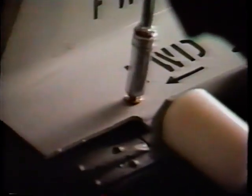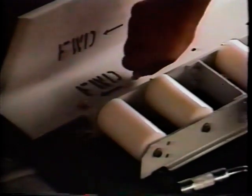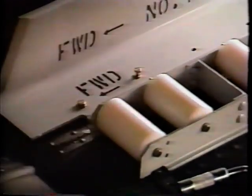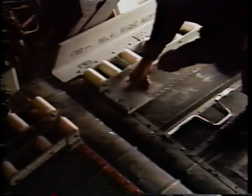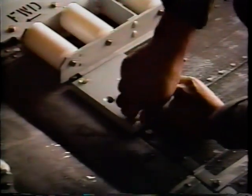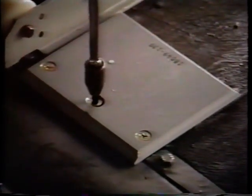To begin the actual installation of the ramp section, position the left and right hand outboard guide rails on butt line 41.577 and butt line 42.432. Align the bolt holes with the outboard holes from which the bolts were removed, and attach the outboard guide rails to the helicopter ramp floor using one hex head bolt and one flat washer at the most forward bolt location on each guide rail. Secure each outboard guide rail at the remaining bolt locations using the remaining 11 hex head bolts and flat washers. Position the transition roller plates on the three holes located at or near butt line 32.024 on each side of the helicopter ramp. Secure the plates to the floor using three countersunk bolts each. Loose fit the bolts before tightening.